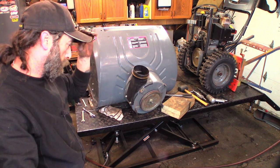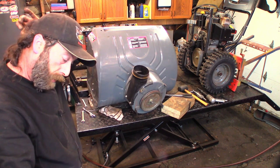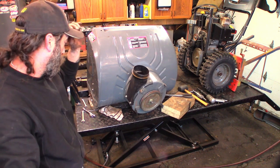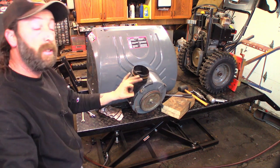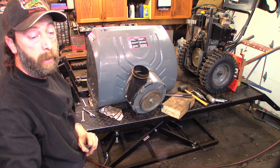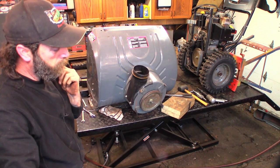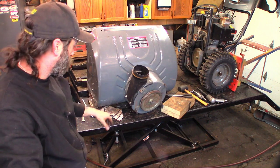After a lot of fidgeting and messing around, got it back together. I could not replace that bearing because the one I had - the inner bore was a little too small, it wasn't going to fit. So I ended up just greasing the old one and putting it back in. It's still a little growly, but it's fine - there's no rust or anything in it, it was just a little dry.